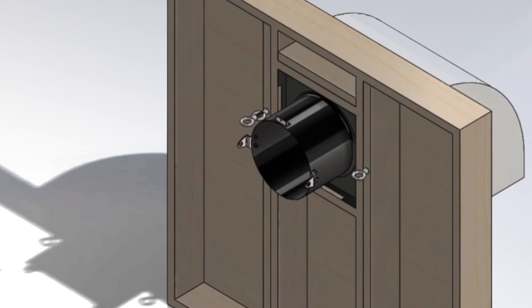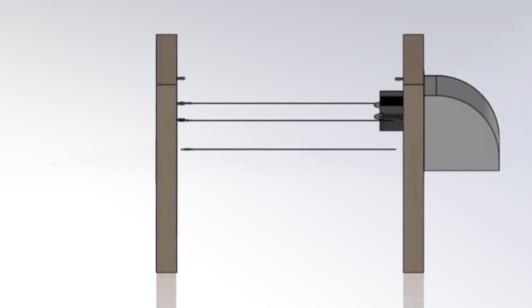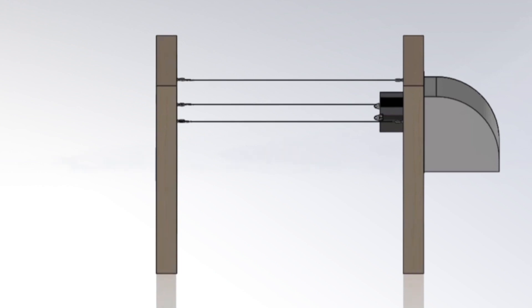Some flap duct systems come with a third suspension cable at 12 o'clock. String the suspension cables between the eye bolts. Tighten cables using the turnbuckles. Some sag will remain in the cable — this is normal and will be addressed later by installing vertical supports.